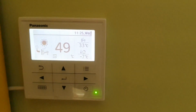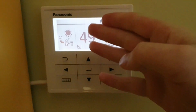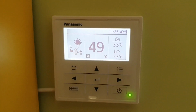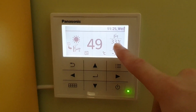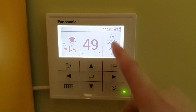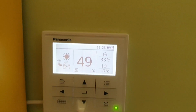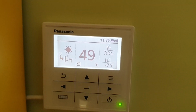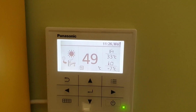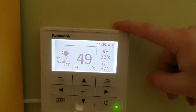Three months have passed or something like that, so I can give you a little bit of intel. As you can see right now, it's heating the water. When it's heating the water, it does this automatically here, and when it reaches the temperature you have set here, for example, I set 43, then it stops heating until it drops down by some value you have set, and then it heats up the home system, where this is the inlet temperature. So this is how I'm heating the home, but you can actually heat it just by setting this to some temperature.